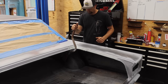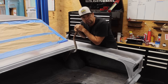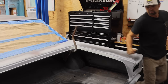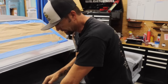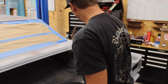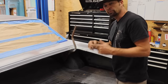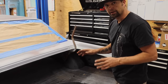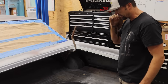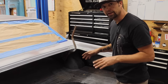We finally got this bracket and hinge on here and now it's good to go. What I did start doing since last we left off a few days ago is I welded this lip all up and then applied just a little bit of filler around here. I had to do it twice — put a first coat, sanded that all down and said it needs one more. So I did one more. We're going to sand that off today. I'm going to push this car back outside and we're getting there. I just want to get this trunk lip area done today so we can move on.